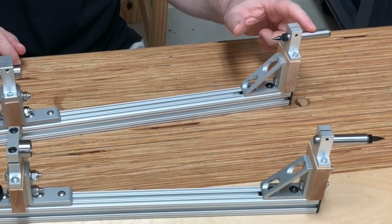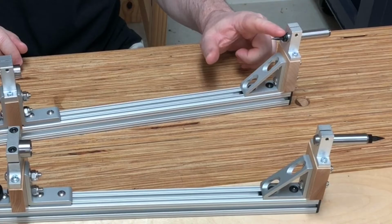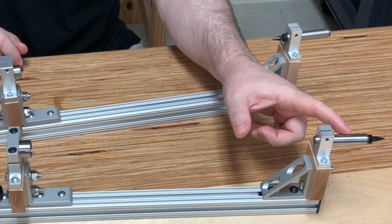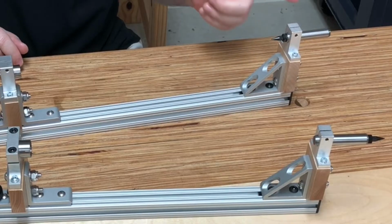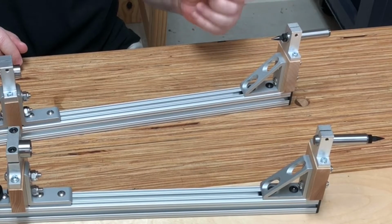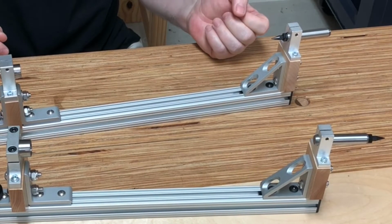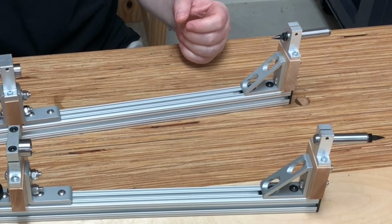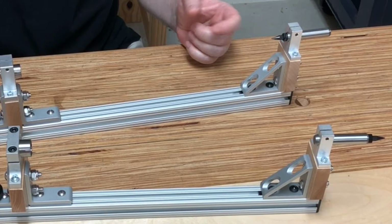On the back side of the steel rod is what I call a pointer. By flipping the rod end for end, like on the large version here, you can now use the guide to drill spindle mortises in arms and/or bows where the mortises and the seats are just marked and will not be bored until after the arm and/or bow spindle mortises are done.